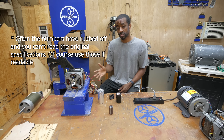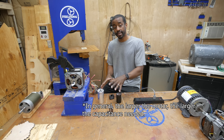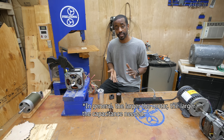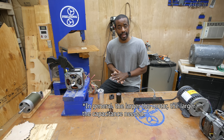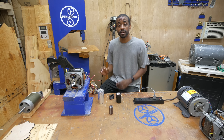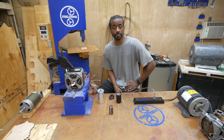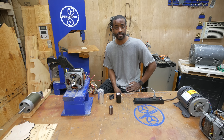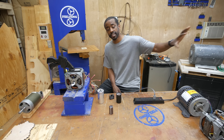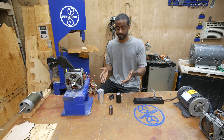This is by far the most common problem with the motor, but before I check that I would check everything upstream in the circuit first. Check your circuit breaker, check the outlet you're using, and try plugging it into a different outlet on a different wall to make sure they aren't wired together. Check any switches in the path, because all of those items are actually more likely to fail before the motor itself fails. But once you've checked all the upstream stuff, look at the capacitor as the first motor-related issue.